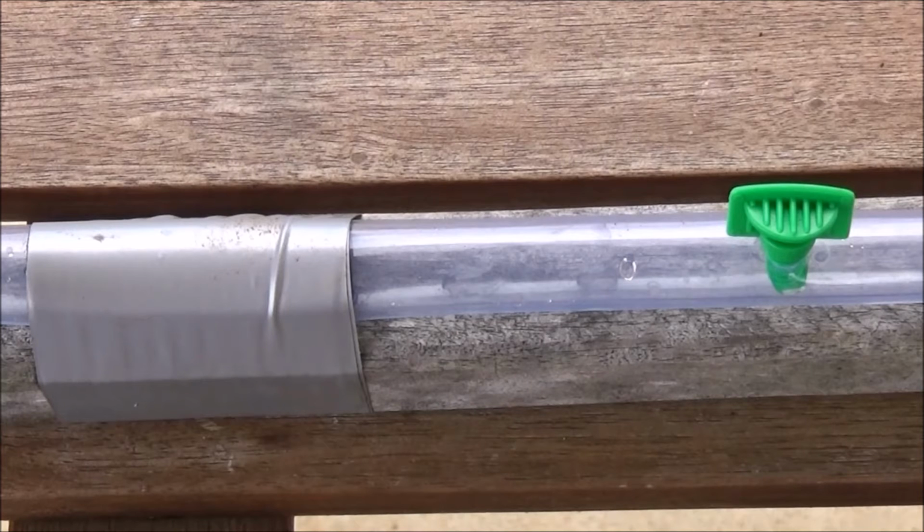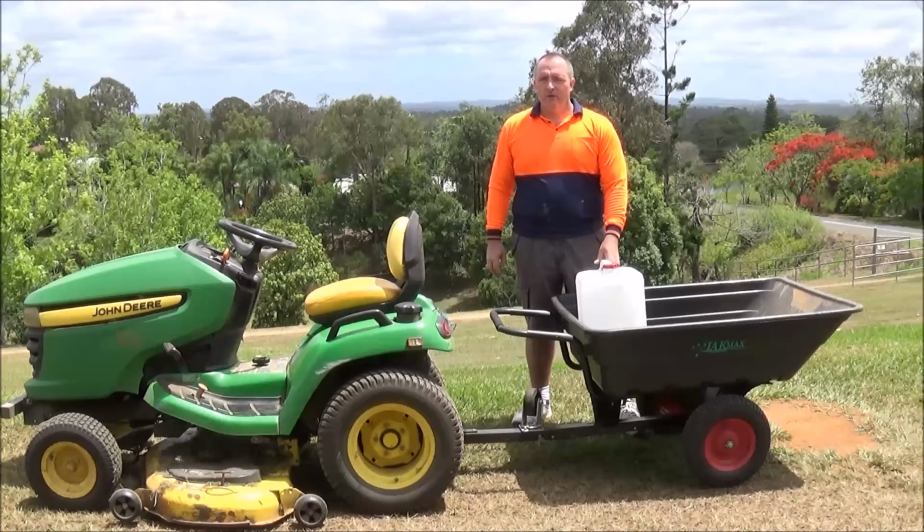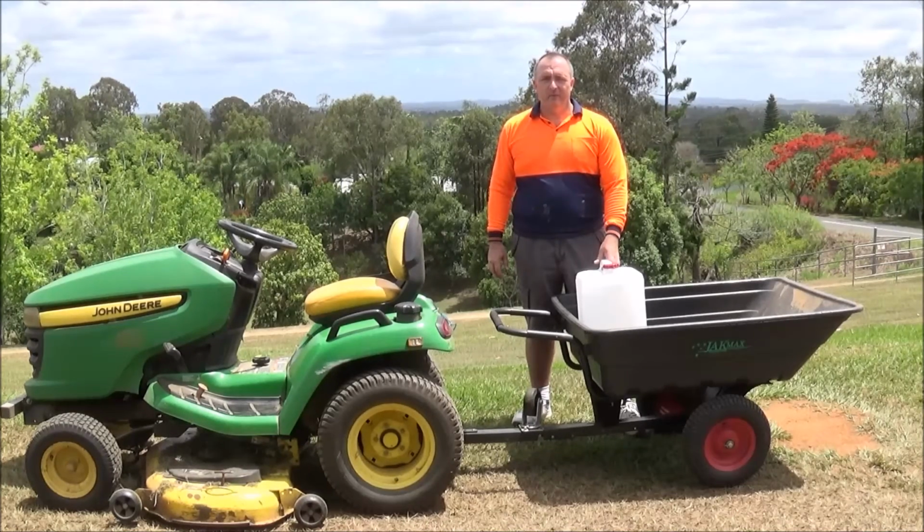The third part is the actual boom itself. It is made from a 6-foot garden stake, a length of 10mm clear vinyl tubing. This tubing is more expensive than using the cheaper poly pipe, but it has way more flexibility in being moved without kinking. And 4 quarter circle jet spray irrigation bits. These bits are placed approximately 50 centimeters apart, and duct tape. I used this tape because it was the cheapest, easiest and quickest way to attach the vinyl tubing to the garden stake.